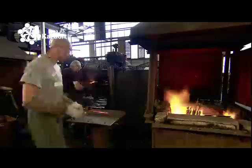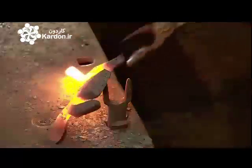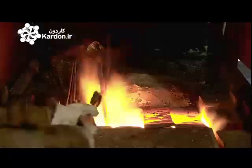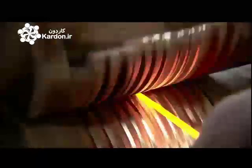It's a completely different process when making digging forks, because of their longer curved tines. After forging a spider shape, a worker bends a prong around a post to position it for shaping. This 2-person team works in tandem. One fires the spider and bends the prongs. The other inserts the prong into the grooves of 2 revolving dies to stretch them.